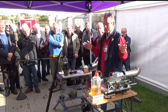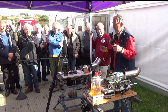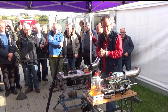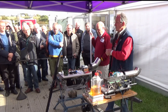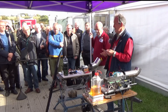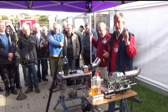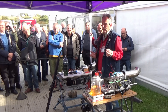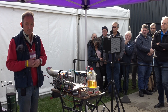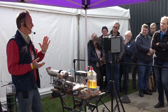Anyway, any questions? Probably the first one that normally comes up is the bearings. We've got one bearing at the front and one bearing at the back. They're basically standard steel races, inner and outer, but we have ceramic balls and we have no cages. So their full name is full complement angular contact hybrid ball races, which is a bit of a mouthful.